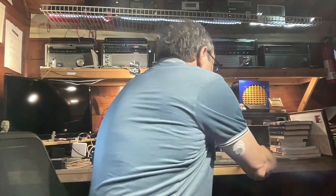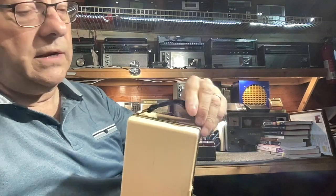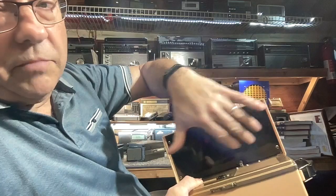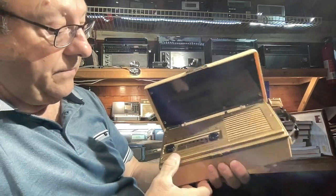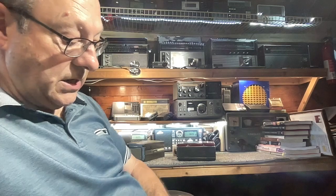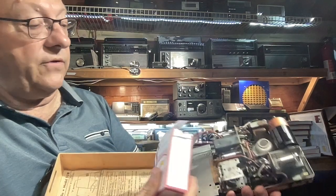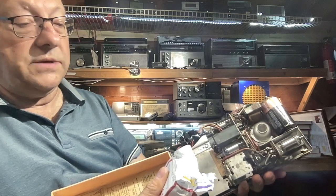Finally, I have another Emerson radio, a slightly older model — again a fold-up pocket with a lanyard on top and a switch in the lid so that when you open the lid the radio comes on. Each one has an antenna built into the lid — you can see the loop antenna panel — and this one has a beautiful veneer dial. The base hinges open and it's got a B battery pack that I built and even printed a little cover for, with a 63-volt battery pack inside.